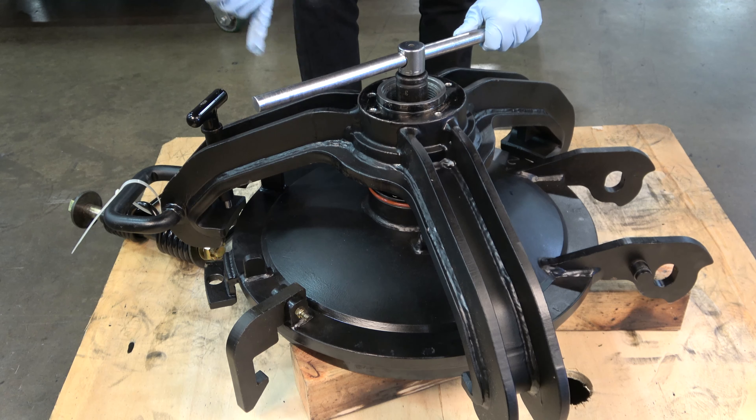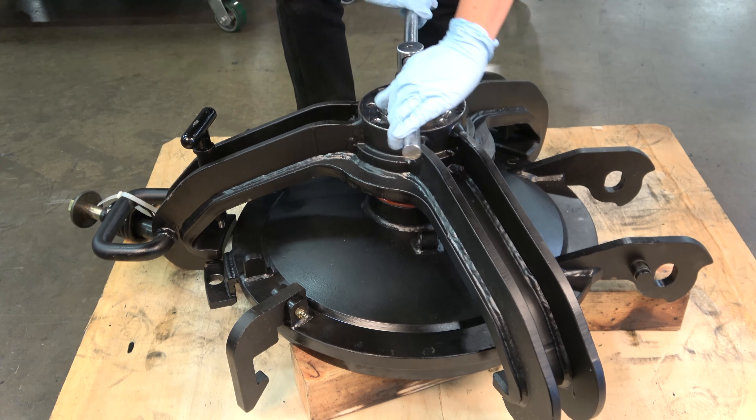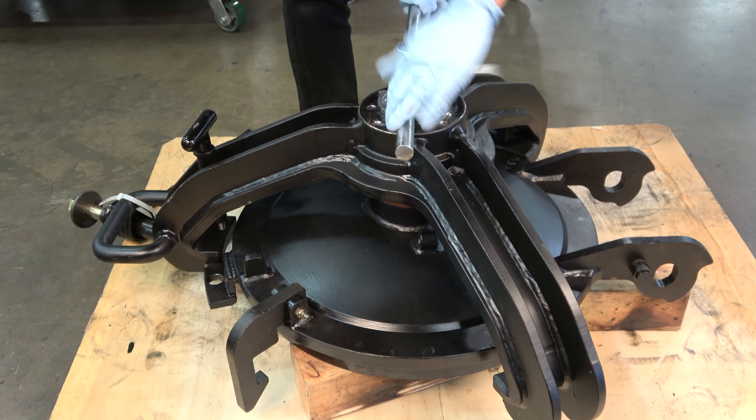As with the disassembly process, there will be an audible thud. Immediately after this point, start to re-engage the thread by turning the ram counterclockwise. The thread should easily engage. If there is any resistance or increasing tightness, stop and start this process over again. The ram will move with only slight resistance of the thread. The strongback will move but will quickly bump into the cover, preventing its free rotation.